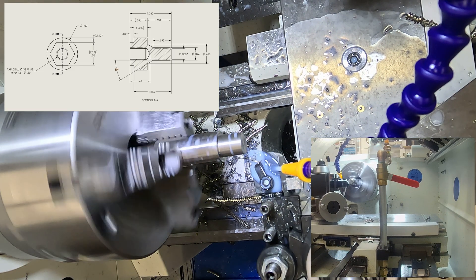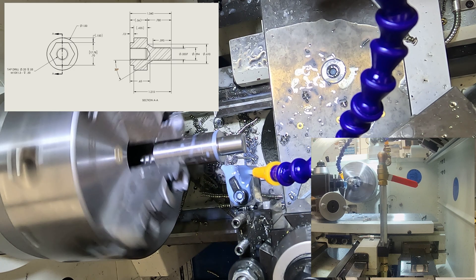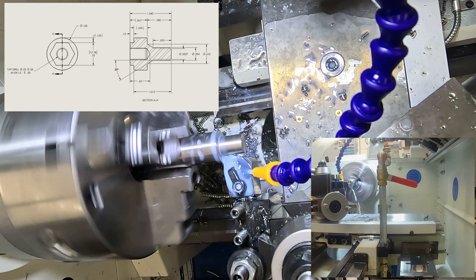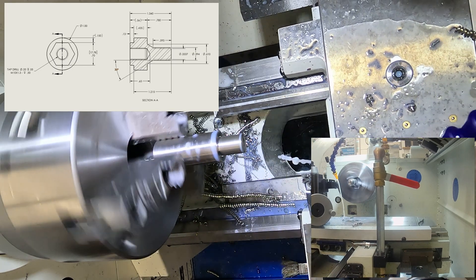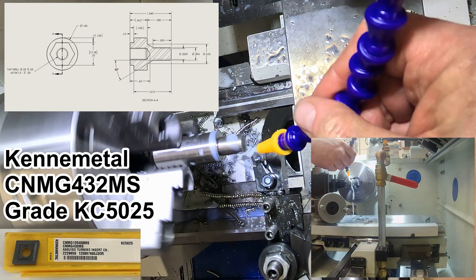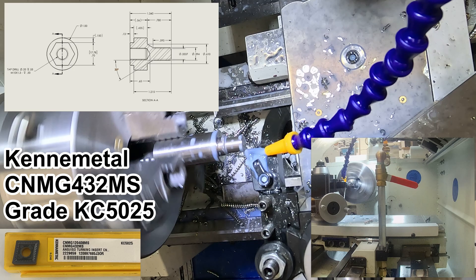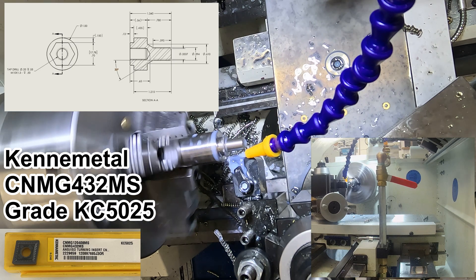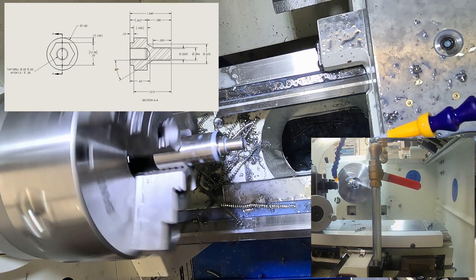What I'm doing first is turning two diameters. The smaller diameter I'm working on now will be used to make the thread for the bolt, and then there will be a shoulder diameter which will be used to make the taper — so the shoulder diameter will be at the major diameter of the taper. I'm using Kennametal CNMG 432 MS inserts, given to me by a machinist to try, and they are really excellent all-round inserts. They're especially good on stainless steel but also work very well on mild steel, and I can take much bigger cuts than 100 thou when I need to.